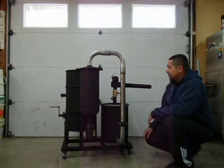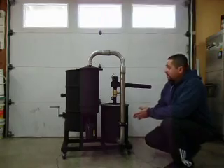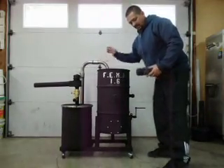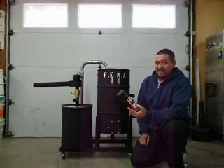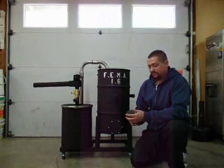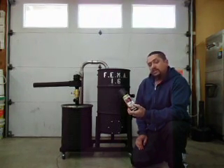I went with black — they had several colors. This is actually a high-heat paint, designed for headers and really high-temperature applications. The name of the paint is VHT Flameproof — it's a really high-temperature paint with ceramic in it. It says right on the can: header paint. I've used this paint before on some kerosene heaters, and I tried several different types and heat ranges of paint. Everything I tried burnt off, with the exception of this VHT.